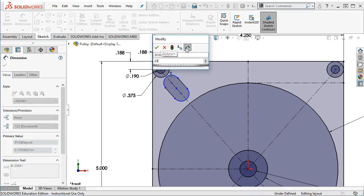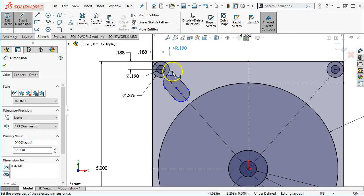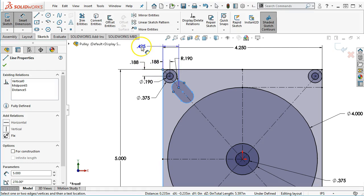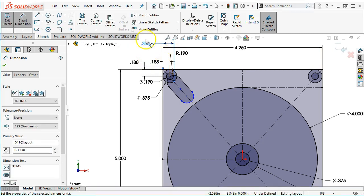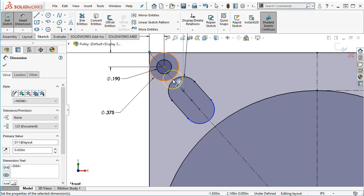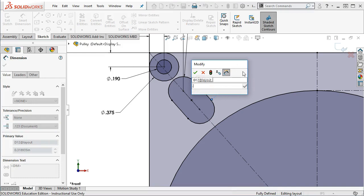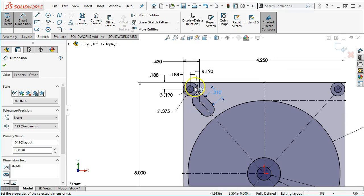All right, so if I go to 0.25, that would be 1/2 inch. Probably not going to need to be that big, so if I were to go to 0.19, let's see if we can find a decent number. Now I pulled it on the angle, mainly because that gives me a good starting point. I don't know how much I'm going to need to move that. We're going to kind of pick an arbitrary 0.43. I'm not worried about it getting into or being tangent to this edge, and or deformation. And then in that case, 8 millimeters, 5/16, 0.31. That would be okay, and the cable is still able to go. All this is giving it relief so that I can get whatever my connection is in there and have it come up tangent to those points.